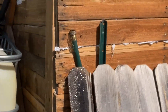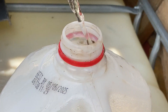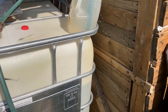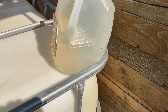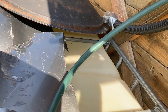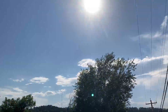We're getting a little bit of flow up top — not bad. I'm going to get my milk jug and time how long it takes to fill a gallon. We just got to the top — it's about six minutes for one gallon. I'll check again tomorrow to see if it can be faster. Six minutes per gallon — it works, but I was kind of hoping for closer to the power-brick rate, which was close to a gallon a minute.